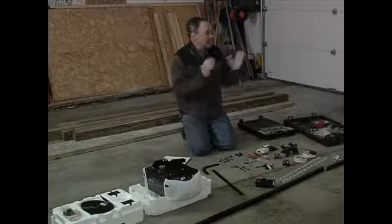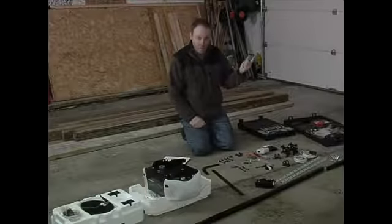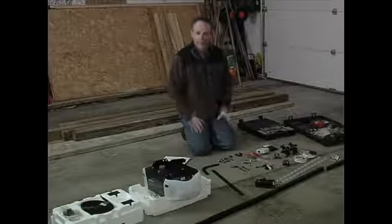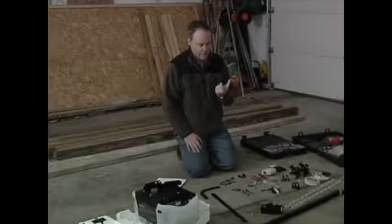Look through it and pay particular attention to connection to the door, connection to the wall, and hanging the opener. So you can go out and get the other parts as you need. What we did is we had to go out and get extra bolts for this particular type door. I like carriage bolts right through the door, not lagged into it.